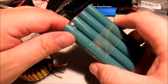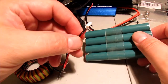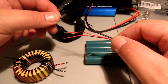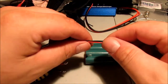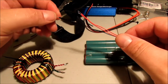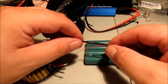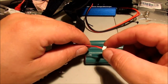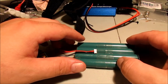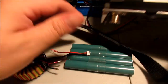So I'm doing two things. One, I stripped this battery pack. This battery pack is bad that I received with the radio. And I took this connector off of it. And this connector I'm going to bring to a more common connector. And I'm doing one thing right now, which is I ordered 300 milliamp hour lithium polymer cells off of eBay, which contain the charge and protection circuitry per cell. And I'm going to wire them in series, and that's going to give me the proper voltage for my 817.